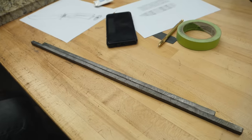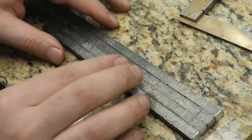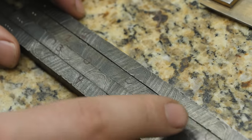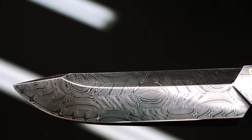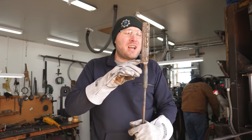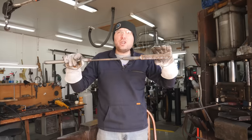With all the practice pieces and this actual billet, there's quite a bit of time already invested into this fighter. I spent a good amount of time laying out our four bars. The two bars in the center of the billet mirror each other, and then the two on the outside are staggered offset to the center but mirror each other on the outside. Here's our billet all ready to go — we've got all four interrupted twist bars sealed up with MIG welds so we can heat it to forge welding temperature. Everything's nice and clean and fits pretty tight.